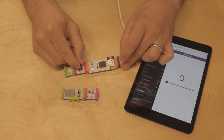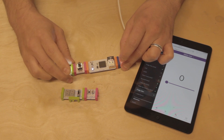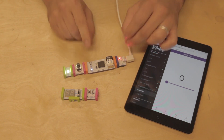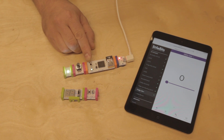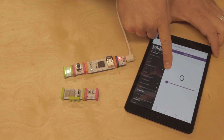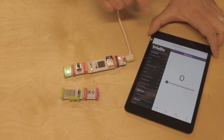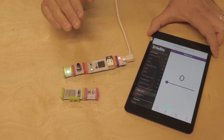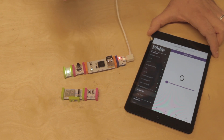We're going to turn our Threshold all the way down to zero and wait for the light on the CloudBit to go a solid green. Once the CloudBit is connected to the Cloud, we select that bit in CloudControl and go over to the slider. We want to set the slider to 40, because that's the temperature that the FDA says your fridge should always be below.